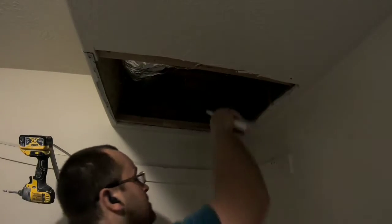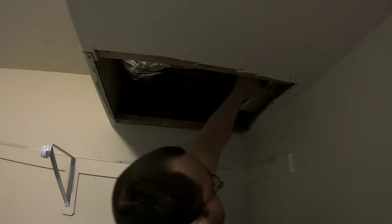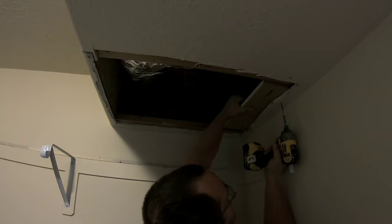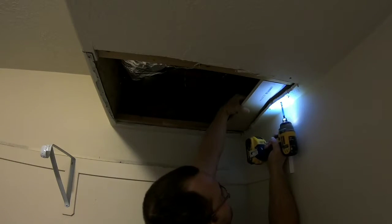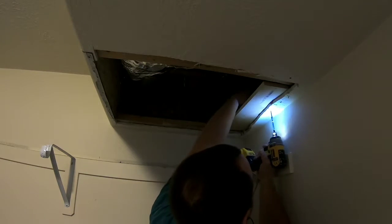From this angle, you can kind of see the 2x4 that I exposed by using that oscillator tool. Now I'm going to add backing. In this case, it is just a piece of, I think that's baseboard I'm using. I just have extra of it. So anyway, I'm just going to screw that to there, and then I'm going to screw some on the other side.